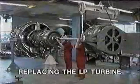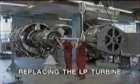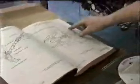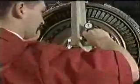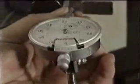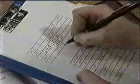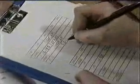Replacement of the low-pressure turbine, Module 50, is almost a reversal of the removal procedure. First, carry out the interface checks according to the engine manual instructions. If the LP turbine module, the HP system module, or any major part of those modules has been replaced, it will be necessary to calculate a new adjusting ring thickness. Refer to the engine manual for details.